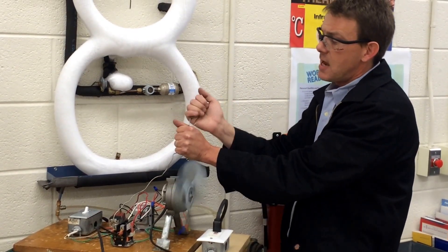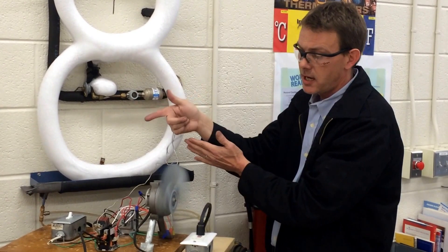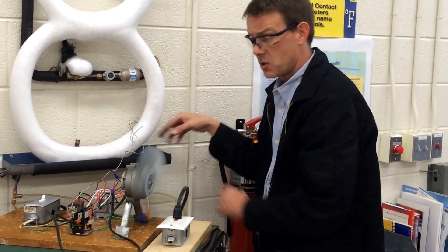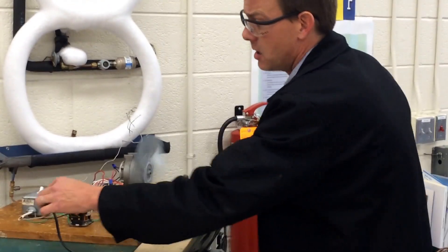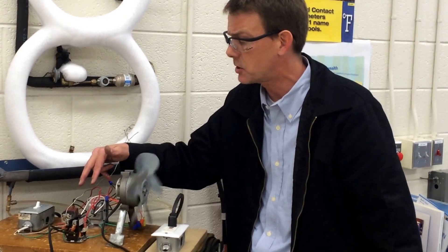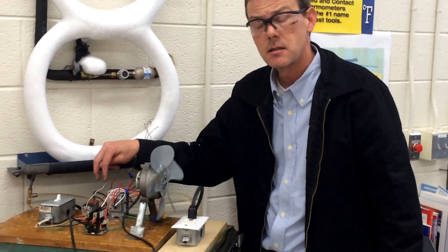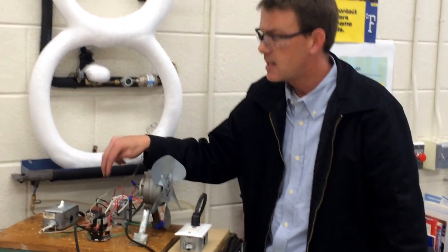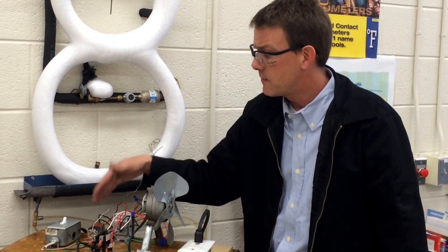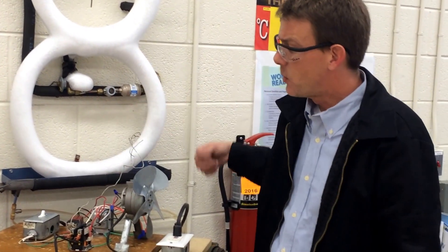It's waiting for something to heat back up, so it would take something hot to warm the pressure and heat it back up to make the bellows in the thermostat push on the contacts again. You just heard it click, and now once it gets cold again, it'll satisfy and do the same thing over and over again. You're going to use the meter to measure voltage at L1 and L2, and also use the amp clamp around one wire to measure amperage on one of the wires going to the fan motor. Measure with the voltmeter across the thermostat with it energized and de-energized, because you're going to get a different reading for when power's going through the thermostat versus when it's de-energized and the switch contacts are open. That's pretty much the third electrical project: single pole switch, line voltage thermostat controlled by a transformer stepping down the power to the coil of the contactor, and a standard 30 amp single pole contactor.